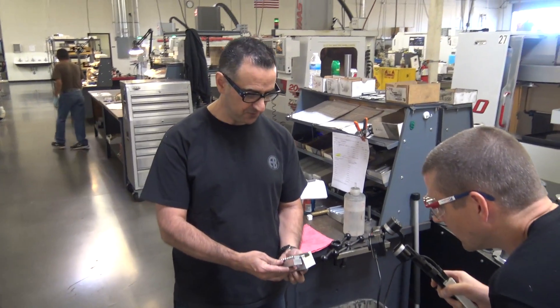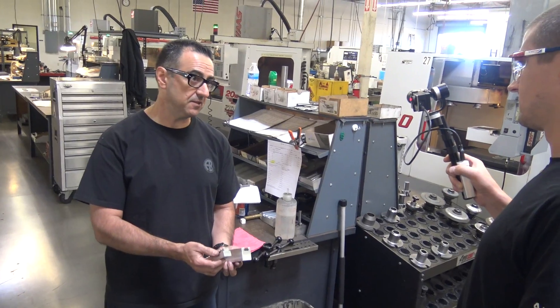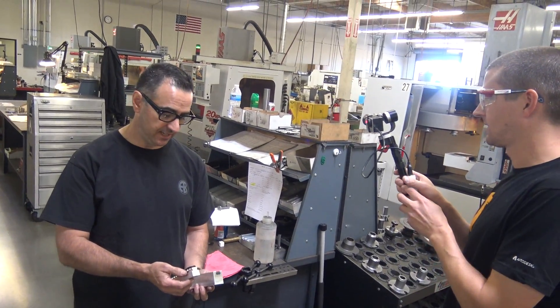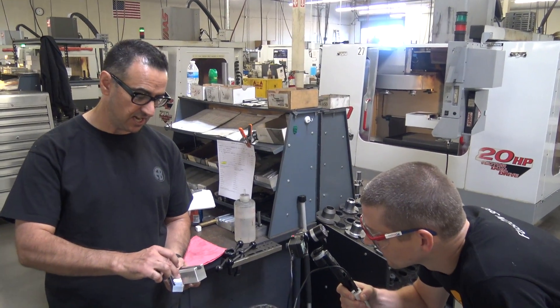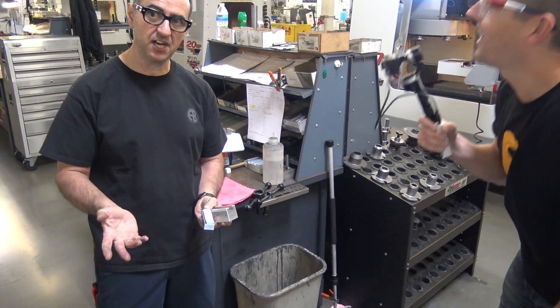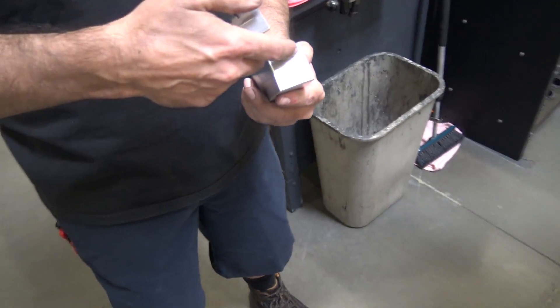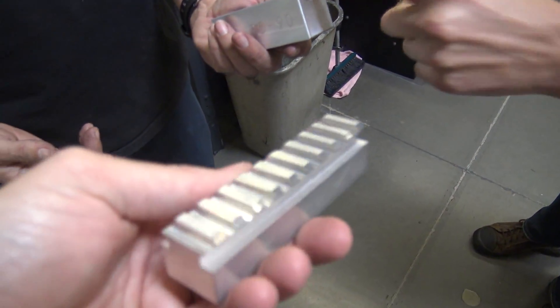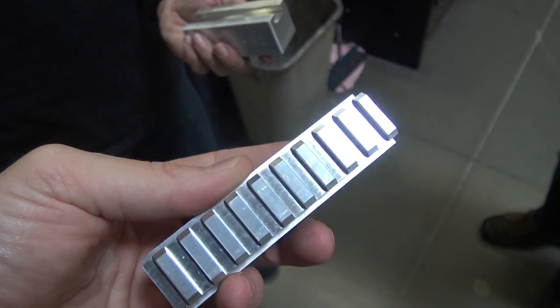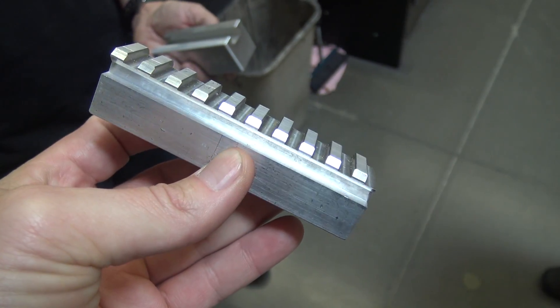Here's a Picatinny setup — this is the one made for INPS. It was made with our female Picatinny cutter and also our slotting tool that does the slots and chamfers at the same time — that's a step tool. We also make the male cutter that does the female sidewall. You run out a slot with a 5/8 or similar, then run our tool through it. That's really cool.